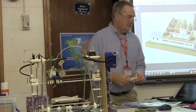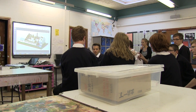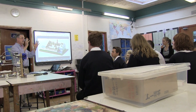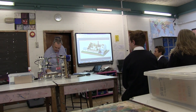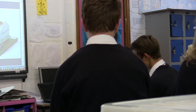You can do quite dense structures as well — that's part of the printer itself. One thing you can do with this that you can't do with injection molding is decide how you fill the interior. With injection molding the plastic fills all the space solidly, but with this printer you can choose — for example, a honeycomb internal pattern.